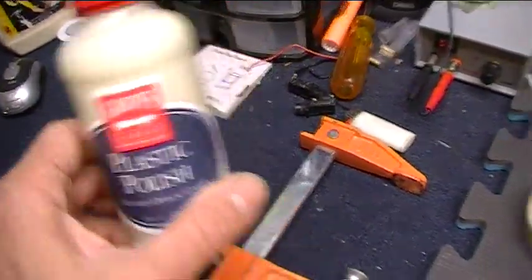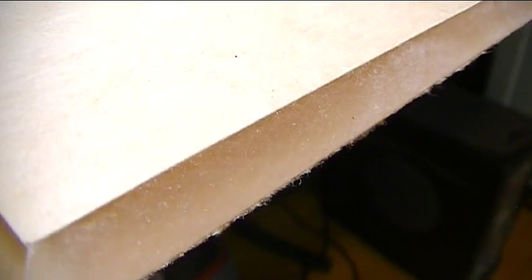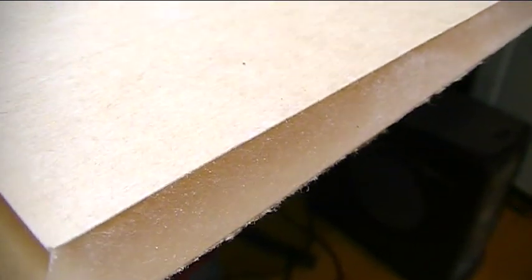I'm using some plastic polish as the final step. I want to show you just how quickly you can polish the edge of a sheet of acrylic. This is just a cut and then it's sanded — that's just sanded with my random orbital sander. 45-degree cut with the table saw, sanded with my sander at 120 grit. It's a little cloudy and you can see some swirl marks in there, but that's the starting point. This is cut with a really fine tooth, hollow ground, seven-inch circular saw blade.